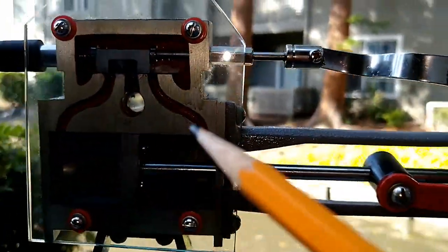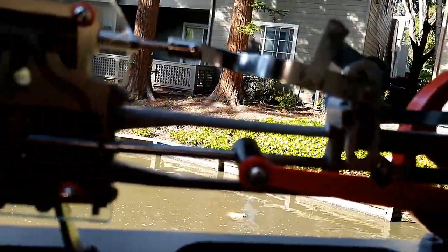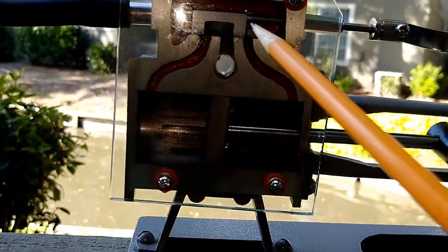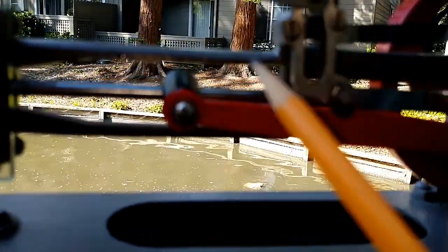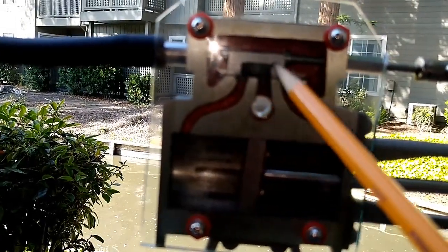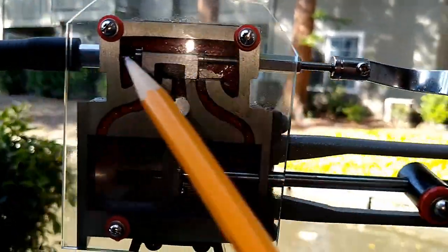It's very unique how steam locomotives are designed as far as the running gear. The valve gets its motion from the valve rod, which is connected to the expansion link, and so on, which ultimately gets its motion from the drivers - the wheels. It sets up the piston to receive the pressure needed to force movement via the crosshead to the main rod and then to the wheel. The valve doesn't move on its own but it creates the setting for motion, setting the piston up to move.